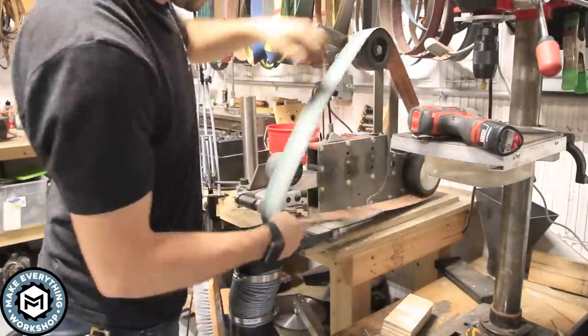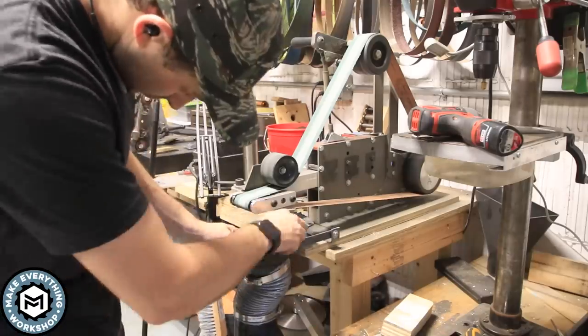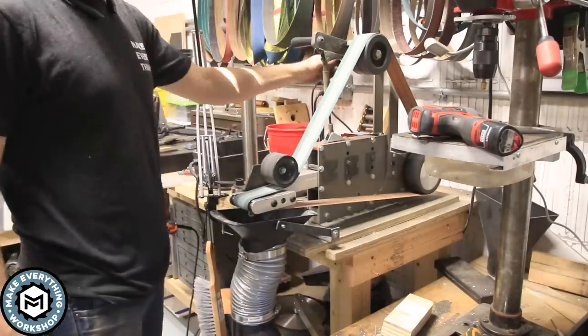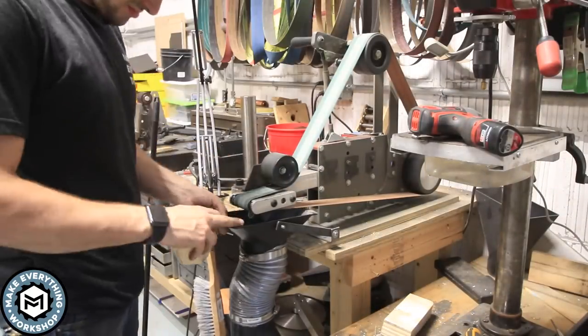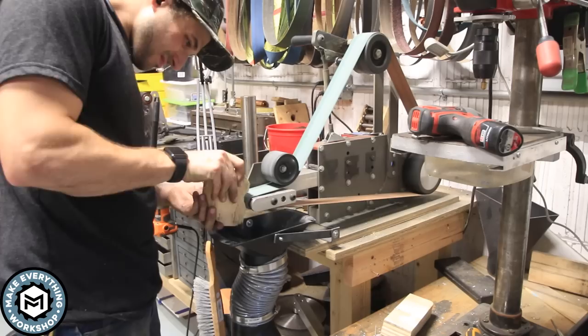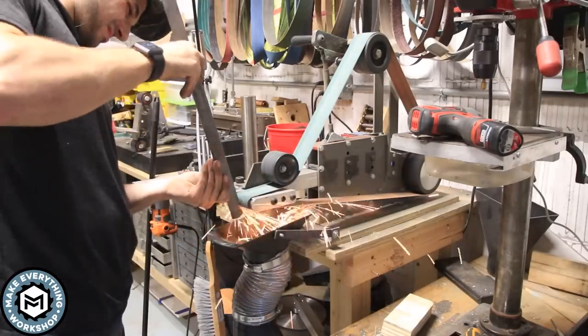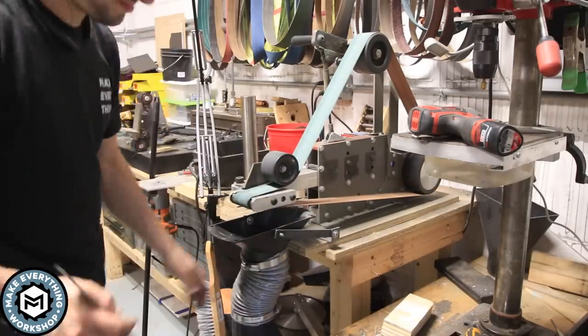So this is a small wheel attachment and I usually use it on the lower arm setting on this grinder. This is a LB1000 grinder. So I'm just adjusting the dust hood here, just making sure that I'm in the right spot. And again, it's a little more difficult to catch sparks with the small wheel grinder, but this is still much better than my old dust hood was doing.